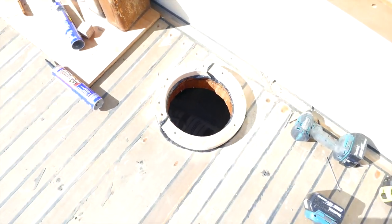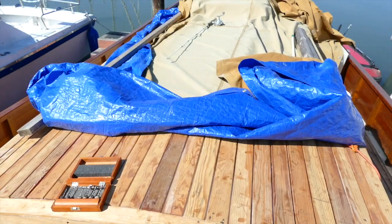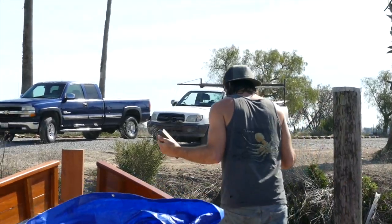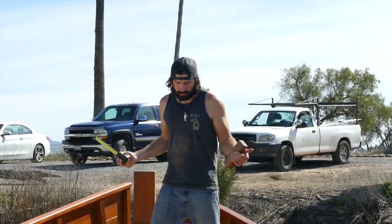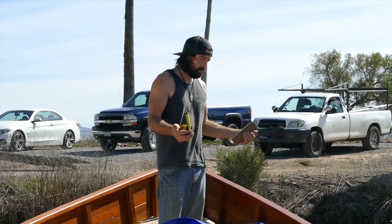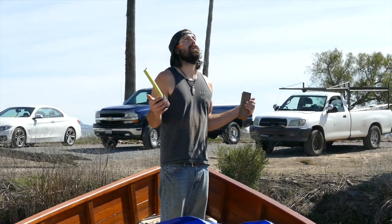Now the mast rim is done, the final construction is to make wedges. Wedges are essential for securing the mast as it passes through the deck, as well as trimming the angle, also known as rake. The mast doesn't sit perfectly perpendicular to the water. It's raked aft slightly.